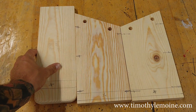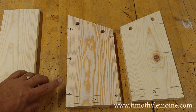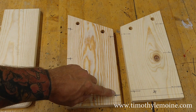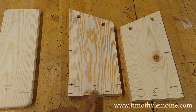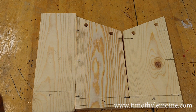These are all the pieces that I've marked for drill holes. This is my back and I'm going to stick a hole there — I'll probably center it, not be off to the side like this. On my sides, along the back side, I have one, two, three holes. This is going to be the front edge, so there's one, two holes there. And then I'm going to put one about right in the middle. Be sure that you're doing these and getting them all drilled the right way. I end up using an eighth inch bit and I'm going to go drill those on the drill press next.